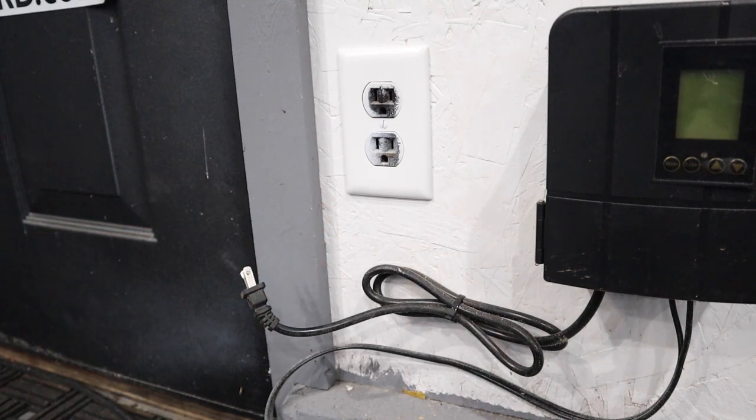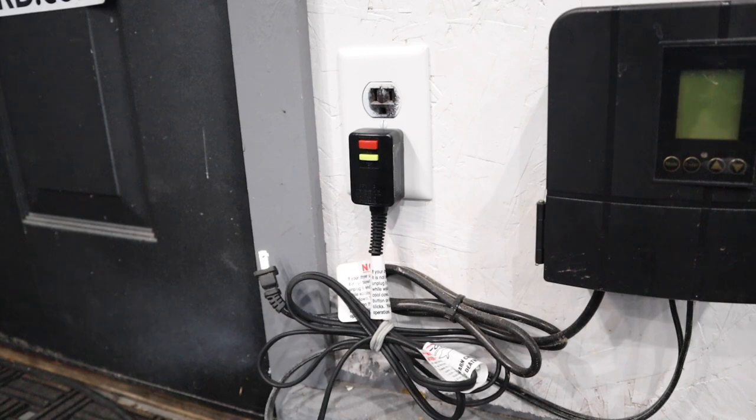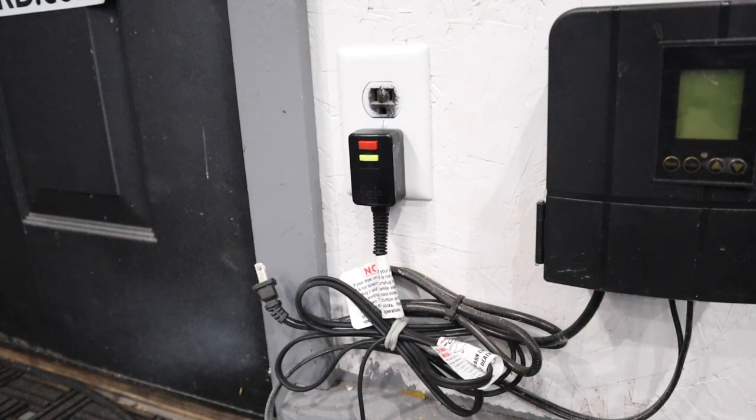The first thing you want to do is make sure that the power is off. You can use a lamp, a radio — anything you can plug into this outlet to check that it doesn't work. Locate the circuit breaker that turns this outlet off. If you don't know which one it is, you can use something like a hairdryer — turn it on and go down to your breaker box, popping breakers off until you find the one that turns the hairdryer off. Or you can have somebody yell and tell you that the light went out.